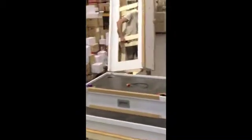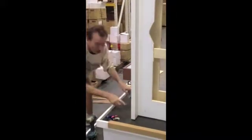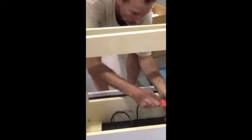Okay, now we're going to put tier 3 onto tier 2. You want to make sure there's a hole in the center for that wire to go in. One person can pick the unit up. Again, we're about 9 inches from the edge. There are 2 alignment pins on this side. Okay. Once the unit sits, it's in position. We'll plug in tier 2 into the female connection. Okay, there we go.